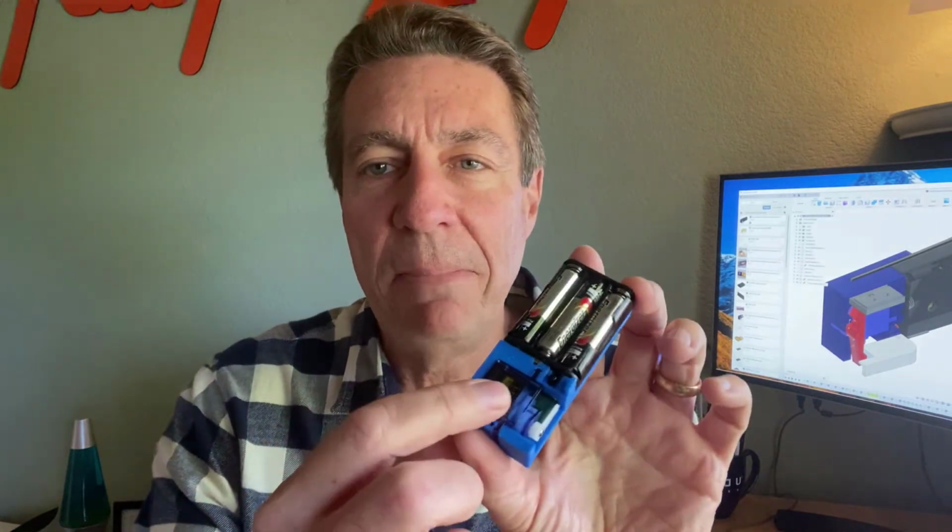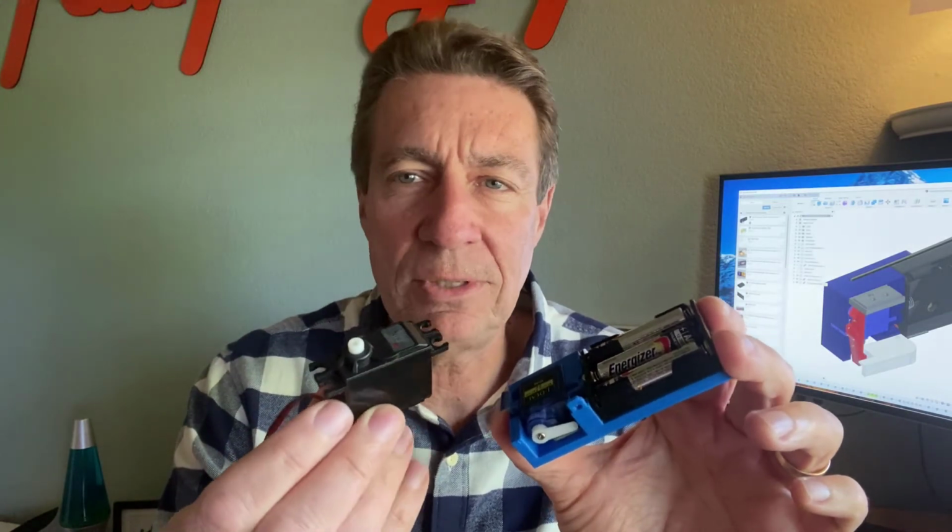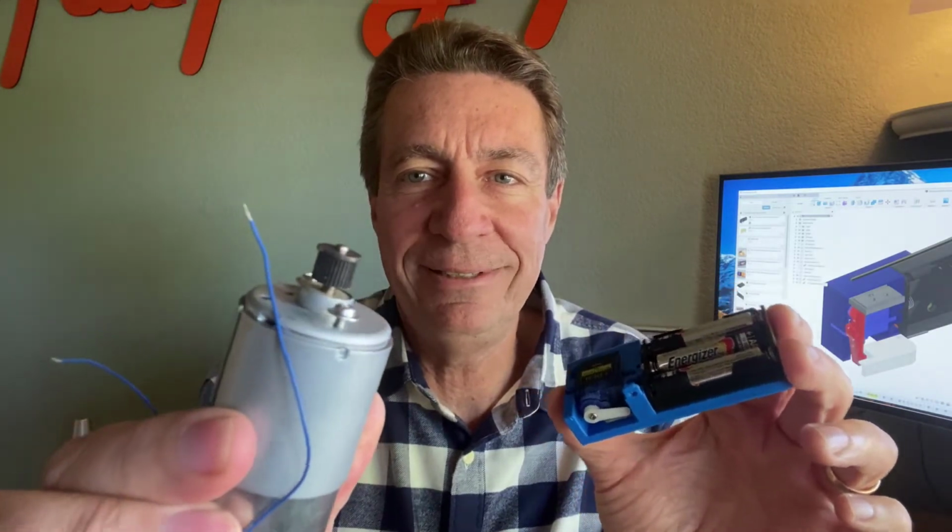One thing I wanted to mention is that our little module here, our secret knock module, uses a sub-micro hobby servo here to move a small latch inside our book. But that could be something bigger. It could be a bigger servo to move a larger latch, something that takes a lot more force. Could be a large motor to actuate something, a gear train or something. Could be a large pneumatic ram, whatever you want. So you could move something very large just by a small controller like this. You could keep all of the electronics and just interface it with some kind of a driver to drive something big.